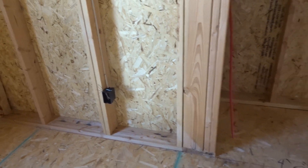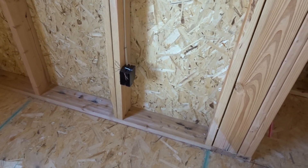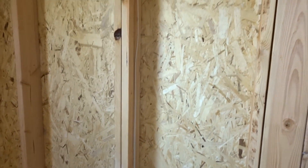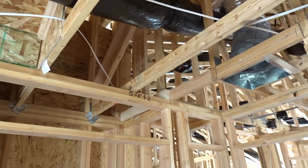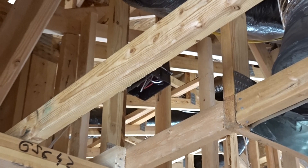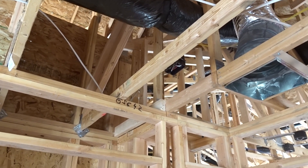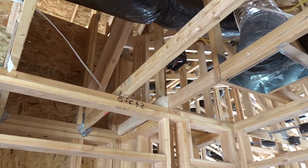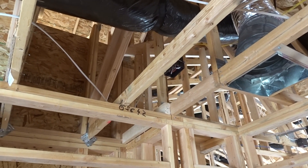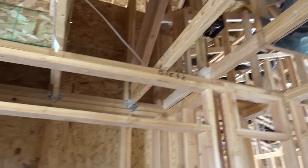Say here's an outlet in this bedroom - there's the closet - so here's an outlet. What I would do is take this last outlet, there's only one wire in it, go up and power up the smoke detectors. Don't forget to power the smoke detectors because they need power to run. The 14-3's third wire runs the signal around to all the other smoke detectors - that way if one goes off, it sends it on the red wire and has all of them go off throughout the whole house.